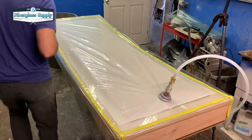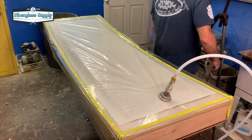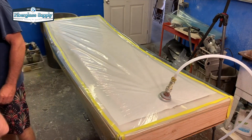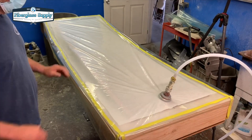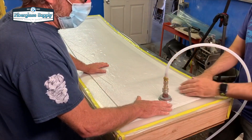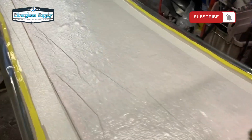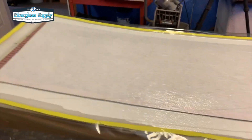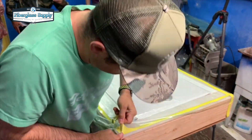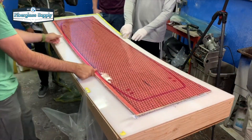After that we're going to hook up our pump and apply vacuum. In this case we are using an oil-bath rotary vane vacuum pump and it's going to pull a full atmosphere — 14.7 PSI. That is more pressure than we really need, but this is a clamping operation so it's not really going to hurt us like it would in a wet layup vacuum bag operation. Part of that is because of the type of pump we're using — we really have to pull full vacuum to keep that pump happy. Now that we've got that under vacuum we're going to let it sit overnight and give time for the glue to cure up. Once we've given it sufficient time to cure we're going to remove the vacuum bag and the processing materials and see what we got. In the next video we'll trim it out and go ride it.